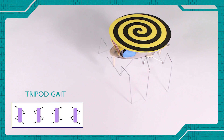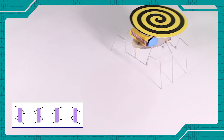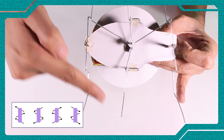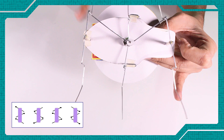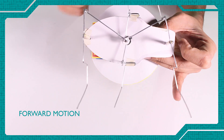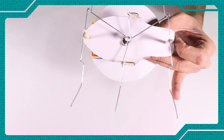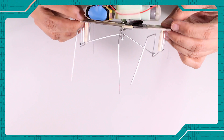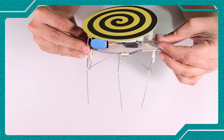In a tripod gait your hexapod has three feet in contact with the ground at all times — the front and back legs on one side and the middle on the other side. The electric motor revolves around a lever which in turn lifts up the middle legs. The middle legs are connected to the front and back legs by the lever system, which helps in syncing the same motion. It achieves forward motion by pushing those feet backwards against the ground while the other feet move forward through the air. Then the hexapod shifts its weight to the other three feet and moves forward in the same way. By continuously shifting its weight using the middle legs, then moving the raised feet forward, it walks forward.